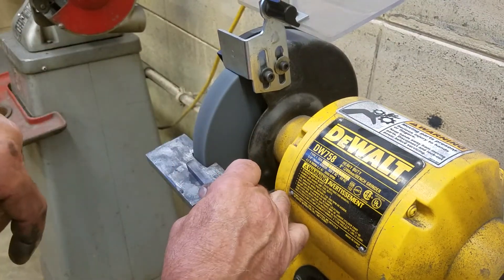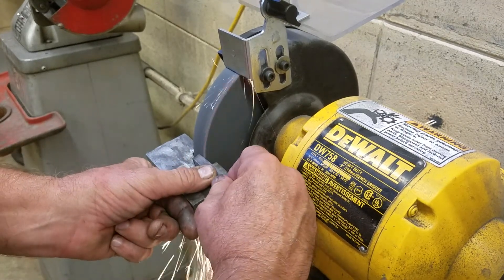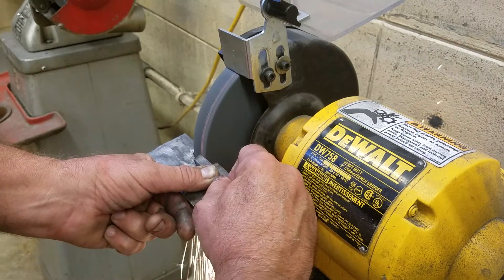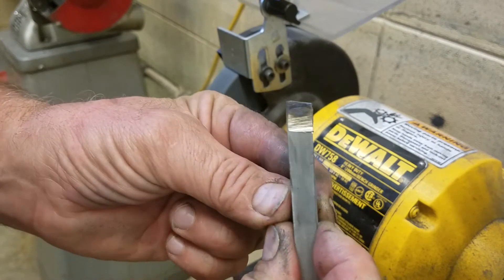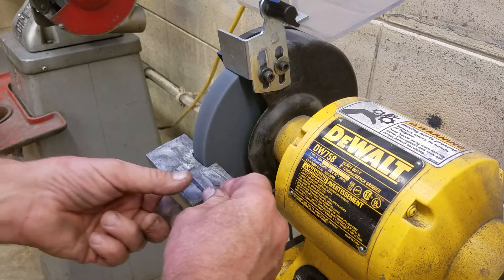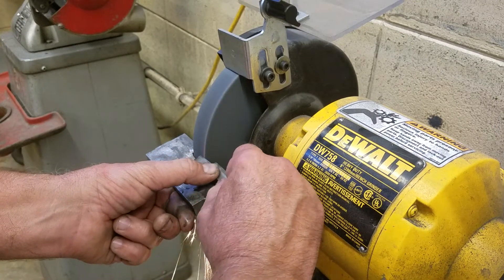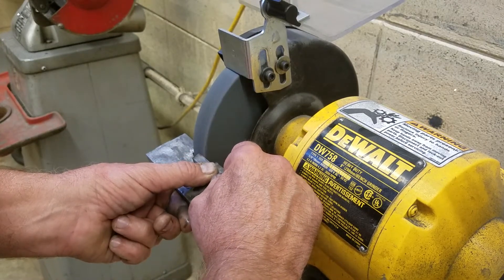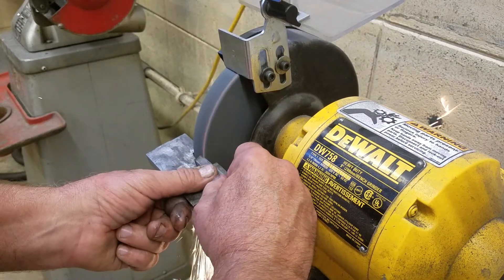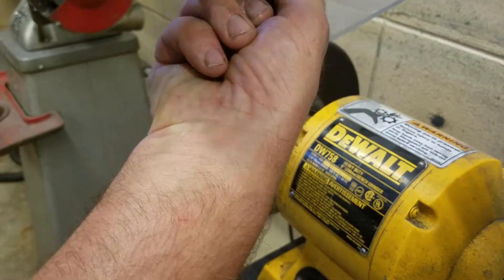See what I'm doing now — I'm going to lean my fingers all over the grinder guard, and put this hand on the tool rest, making sure my hands are not going to go into that grinder. We're bringing it all the way up — it's about a 16th away right now. Sometimes it's a good idea to slant it back just a hair — you'll get a little bit better drag. There we go — let me go just a little bit further. Now you can see how we have this relief on the top. We used to call it the top relief angle.